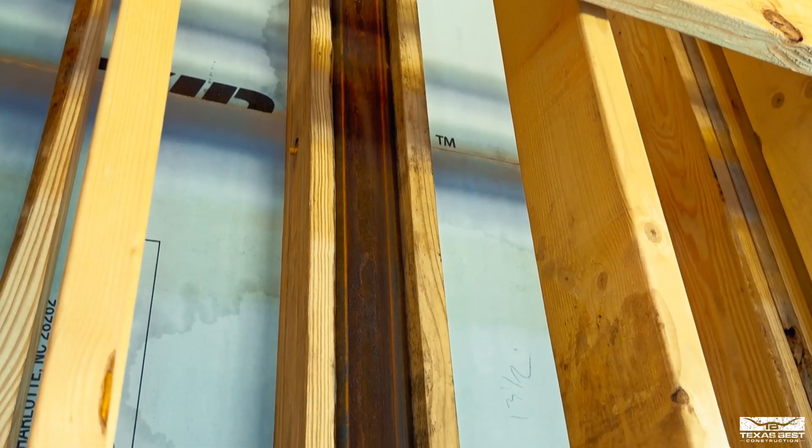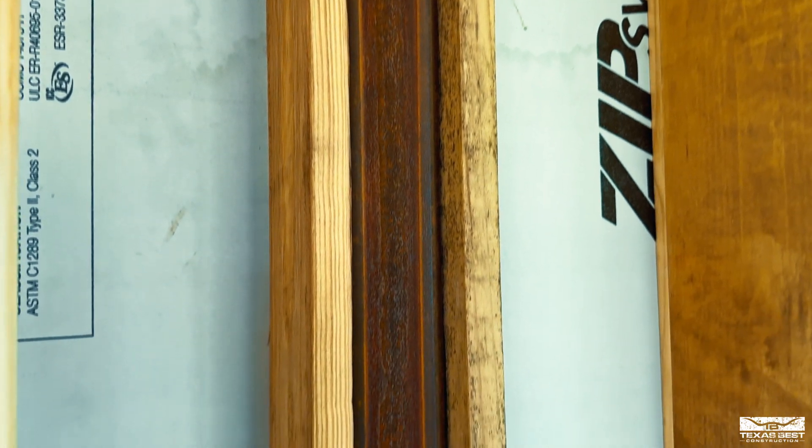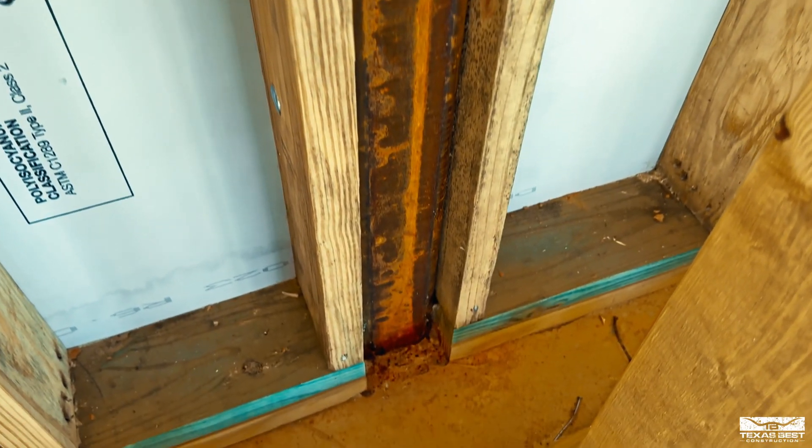We use sleeper studs where we'll use two of those tech-coated screws. For our main columns, we're actually fastening those two-by-sixes using shots — caliber shots — into that steel. So nothing is moving independently. It's all moving together, and even then we're not going to see that kind of expanding and contracting.